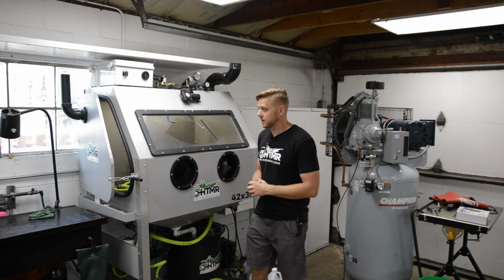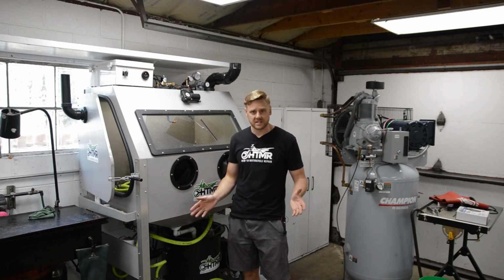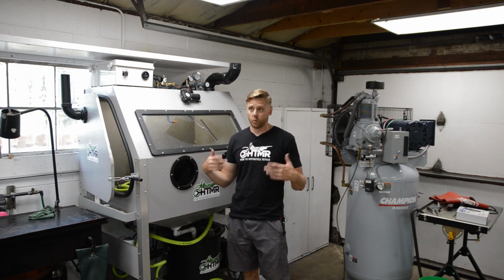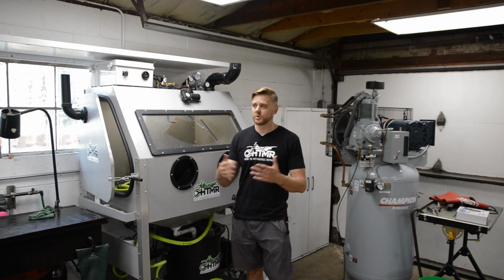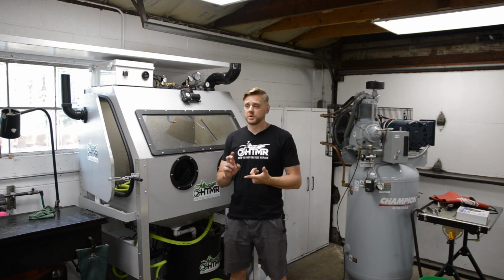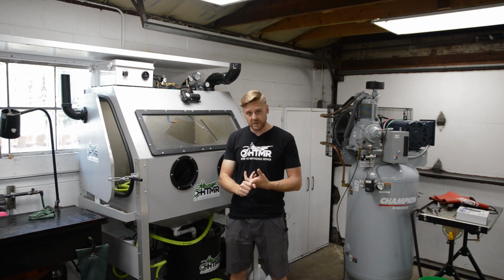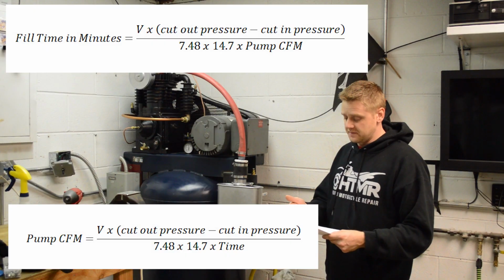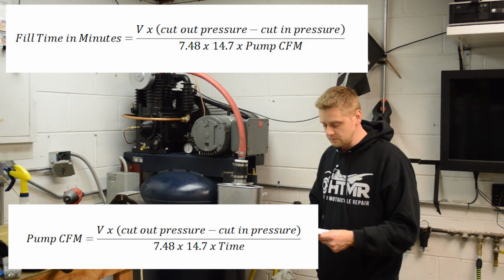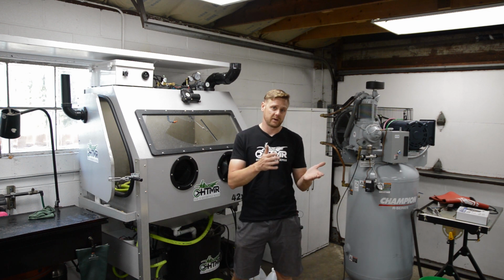Okay, the third way you can determine CFM, or let's just say you have a compressor and it doesn't have any stickers, no labels, it's old as heck, it's dusty, and maybe it's not even working like it was brand new. So you have no idea what CFM it is, right? Well, I came out with a video up here. I'll link to it. You can calculate how much CFM your compressor makes by timing a certain PSI range. So let's say 100 to 120. You time how long it takes to go from 100 to 120, and there's a formula, and it'll tell you what CFM it is putting out in that range.